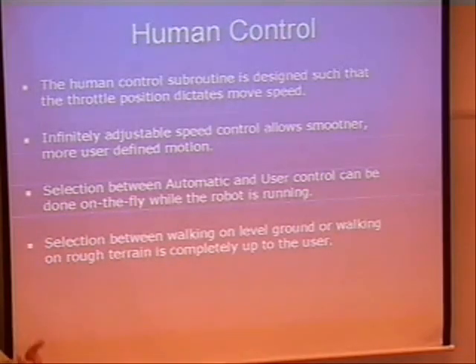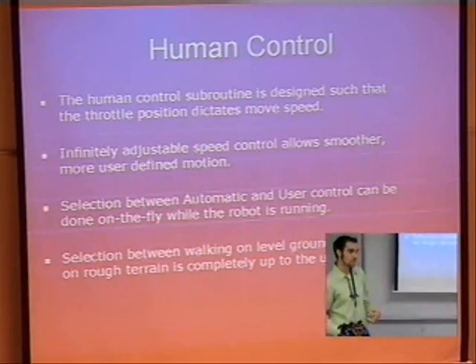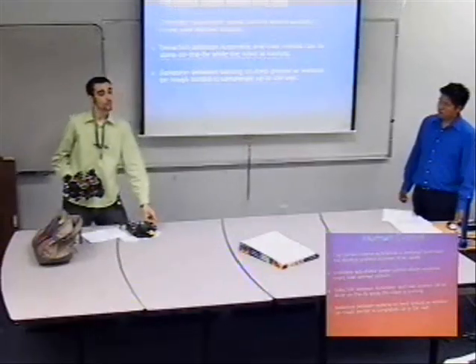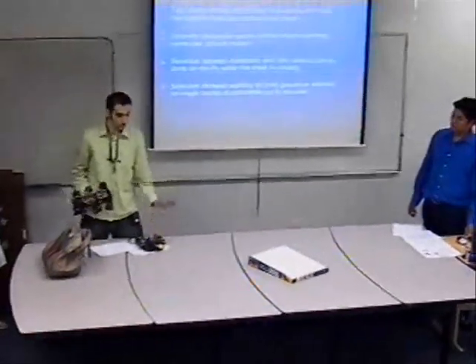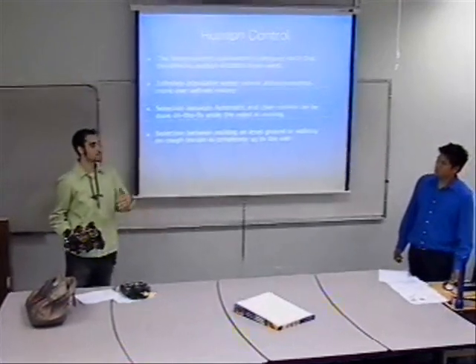Now, if you want to control the robot while it's in motion, you have the ability from the controller to switch between autonomous and human control. So if it's an emergency or it's about to fall off something, you can switch modes. The way that's done is using a pulse-in command, which registers the position of the controller. If I pull left, I want the robot to go to autonomous control and do whatever it wants. If I push the stick right just one time, it'll go into RC mode where I control it. This do-until loop will continue testing for whichever mode it's in.